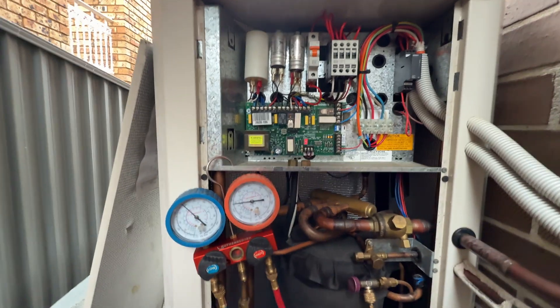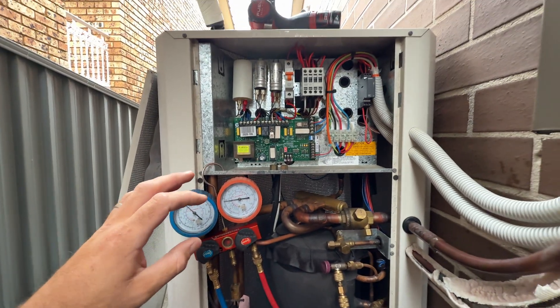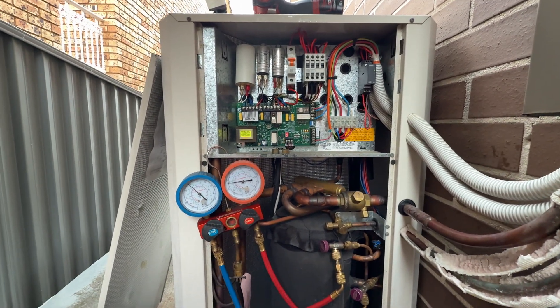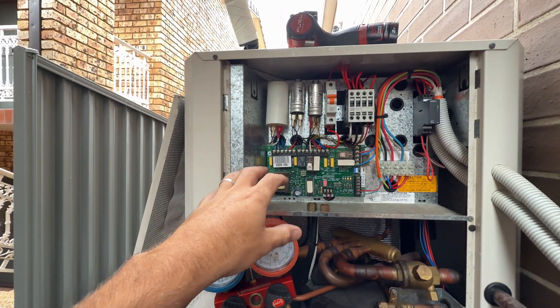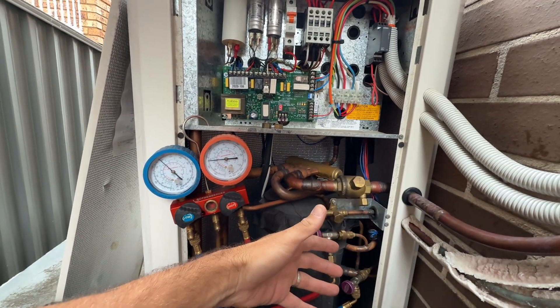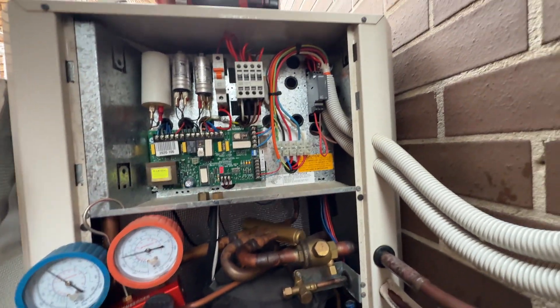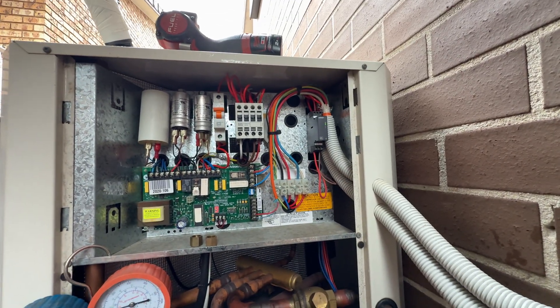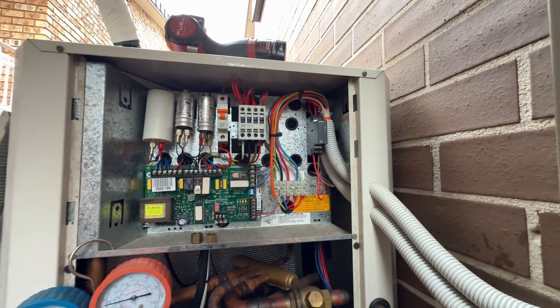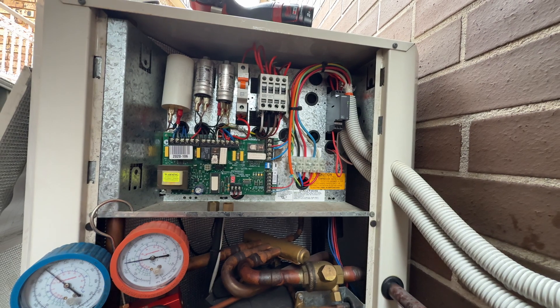I just went and turned it on, was waiting for it to start, and it didn't even get to the point where it was running before it cut out on an E9. Normally, E9 can only be caused by a high pressure or low pressure fault — but in this case it's different. There's one more thing, and it's this: a three-phase sequence loss cutout.